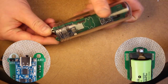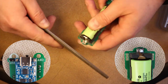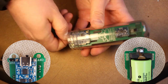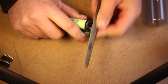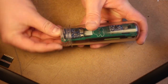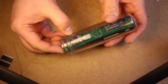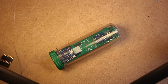So I'll pop up a picture just so you can see what mine finally looked like when I was done filing. You can see most of the bottom pin was filed away, and the sides just a little bit. This particular iSpindel just happened to float at 25 degrees in pure water after offset calibration without the need for external weights or moving the battery up at all. We will cover 25 degree in pure water calibration in a separate video.